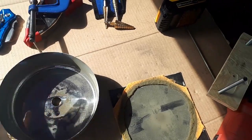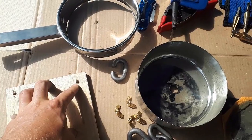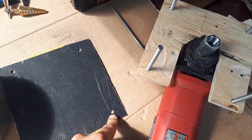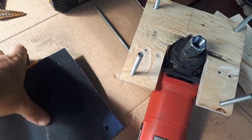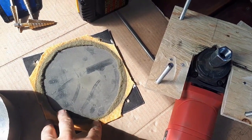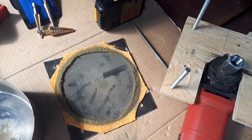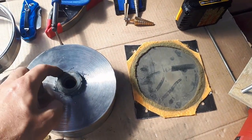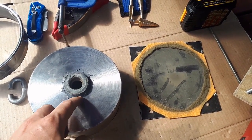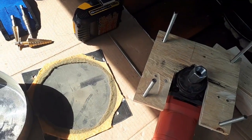You have to drill out a five-eighths inch hole so your angle grinder bolt freely spins, drill your quarter-inch holes in the pieces of wood for the threaded bar, and drill those holes in your metal plate as well. I used some gorilla glue around a circle and glued on the chamois material as my dust seal to keep all the crushed rock inside. If you're going to use JB Weld, give it at least 15 hours to set before you put the thing to work.